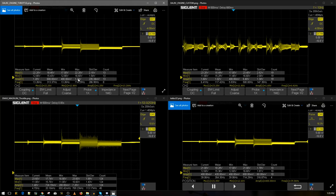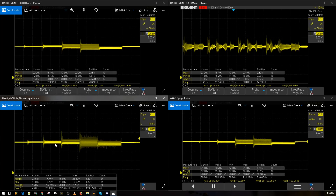Looking at the DALRC Engine throttle level noise test, the spikes on the transitions are very well filtered out. You don't have those very nasty large spikes that some ESCs produce. Compare that with the EMAX Magnum down here — look how dirty that signal is. And remember, on 4-in-1 ESCs, all the capacitors are working simultaneously for however many motors are running. So all 50-odd capacitors on the EMAX Magnum were filtering just one motor in this test, and it still looked terrible. Imagine running four motors, or a larger 2306 motor — it could potentially catch fire.